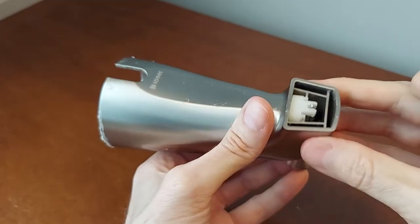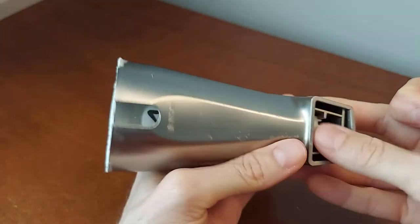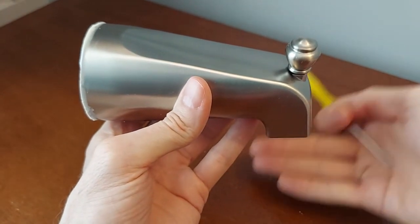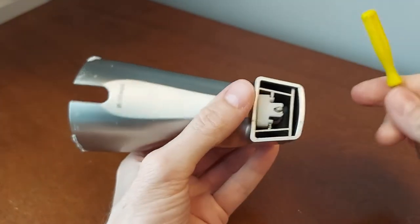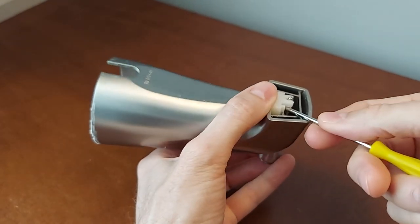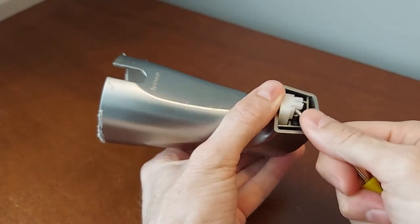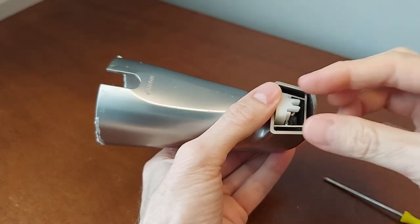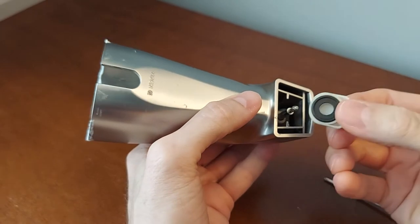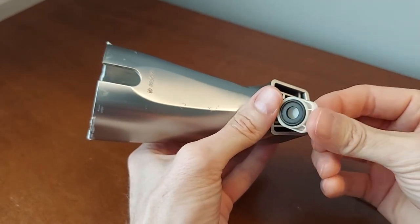So if you turn these things over, you can either do it with a mirror installed and look up into there. But all you need to do is take this thing off — just put a screwdriver underneath there and pop this thing off. Pretty simple. It comes straight out like that and there's your washer — that's what we need to fix.